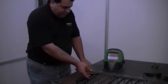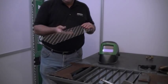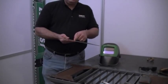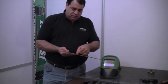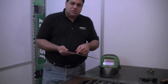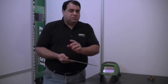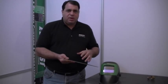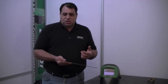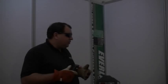We also have 3/4 by 9 expanded metal. The pilot arc on the machine keeps the arc going to transfer over into the next cut you need to make on expanded metal. A pilot arc machine is really good for cutting expanded metal, but a standard high-frequency machine without pilot arc is not very good at doing this because you have to restart the arc every time.